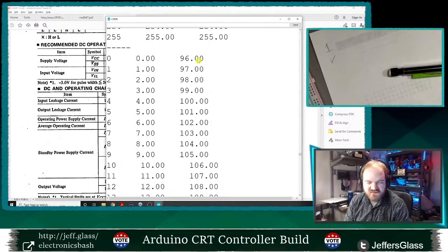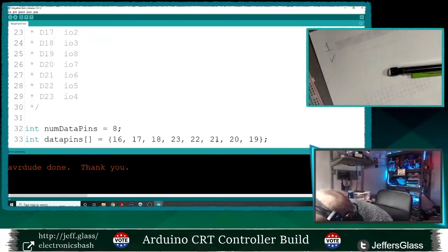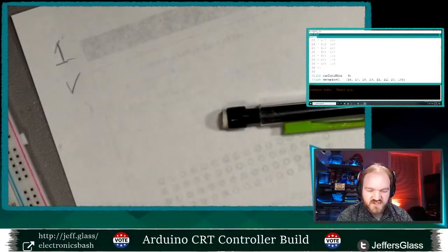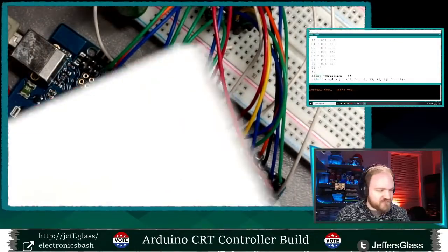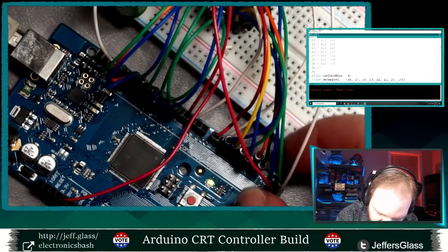So now it's as if the pins corresponding to 32 and 64 are always high. So 1, 2, 4, 8, 16, 32, 64. So pins 21. That's those same two pins. Look, the pins I was having an issue with earlier were this red and black wire down at the bottom here, which are always reading high. So I'm gonna just swap to two other pins.